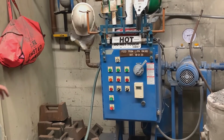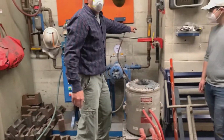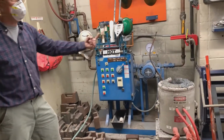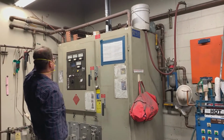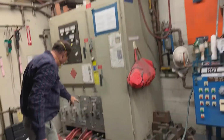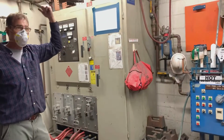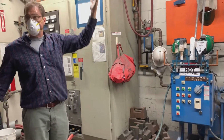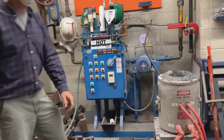Okay, and then what we're going to look at is a couple of things. There is a thermocouple right here. It takes the temperature of the outgoing water. Okay, so if you look carefully here, this is the water cooling outlet, and this is the water cooling inlet. We cool this actual electronic unit, and then it goes out to the furnaces, and then back to this. So it's this big loop. Outside is basically a car-sized radiator that has fans on it. And those fans will keep this at a maximum, I think it's 80 degrees.